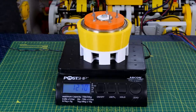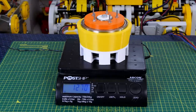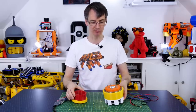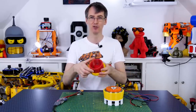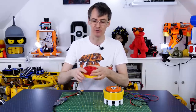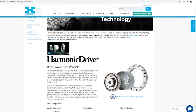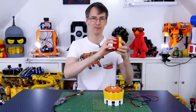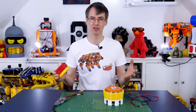The mass of the whole assembly including the motor is about 1.2 kilograms; the motor weighs about 450 grams. This is about 100 grams heavier than the cycloidal drive even though the cycloidal drive had many more bearings in it — that's mainly due to the massive output bearing in this assembly, even though the flex spline is lighter. It sounds amazing like a proper robot actuator and it seems to run pretty smoothly, although there is more friction than the cycloidal drive just due to having to deform that flex spline all the way around. The commercial harmonic drives made by the Harmonic Drive company are basically made of metal, so there is quite a lot more friction there than other types of drivetrains, but it does run really well with pretty much no backlash and you can't back drive it — so it's kind of locked like a worm gear.